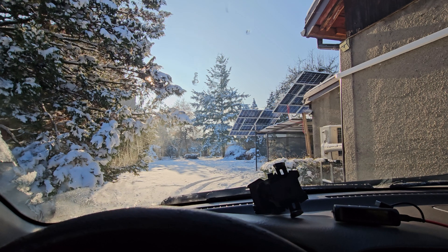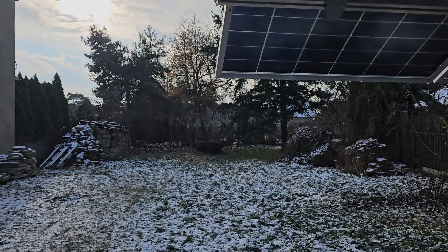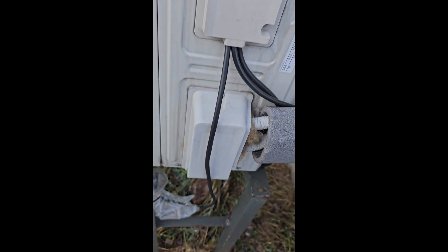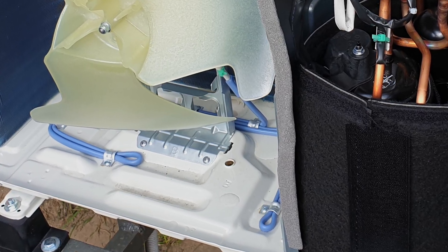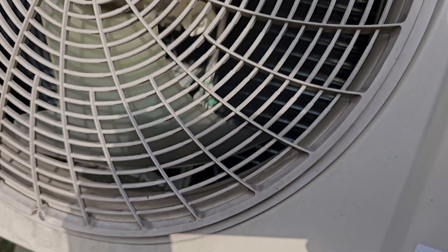The second idea is very tricky. If there is usually lots of snow at your location, don't bother. Here in Poland last years there was barely any snow but it's cold, so I decided to add a manual switch for the drip tray heater which prevents icing on the tray. The heater usually turns on when temperature is around 1 degree or lower, and in my 3.5 kilowatt split it uses around 80 watts. 80 watts might sound like nothing, but if it works 24 hours, 7 days a week for 4 months, then you can imagine it could be pricey.